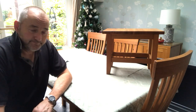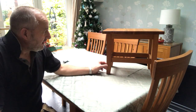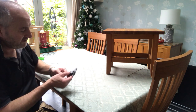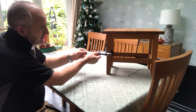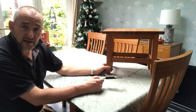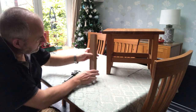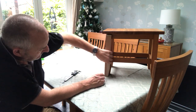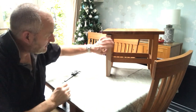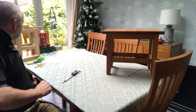Good morning. I had some scrap pieces of oak in the workshop and decided to copy this table, but I need one that's only that much square. I've got some 45 by 45 stock — this finishes to 40 with my digital vernier gauge, only cheap but quite handy. I'm going to rip it down to 40 just to keep the stock looking the same. I'm also going to copy the splay detail on there.